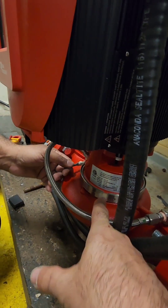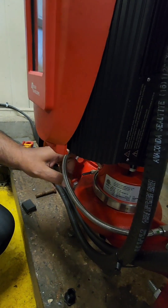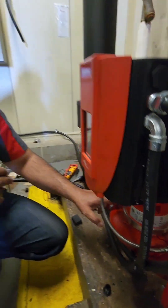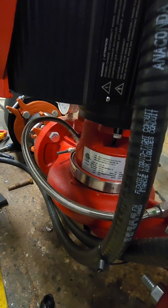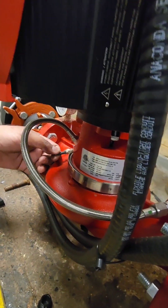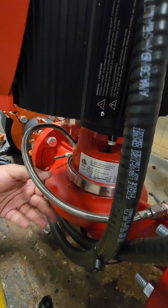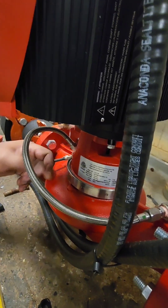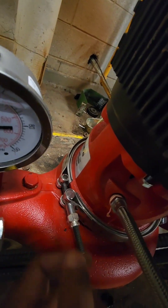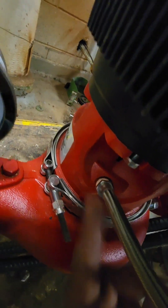This clamp here, Manny — can you explain the purpose of that? I don't see any bolts down there. So in our Gen 5 pumps, these are magnetic pumps, so we don't use bolts — we use clamps. That makes it much easier to pull. This is a pump adapter; the bolts are connected with the clamp and inside there's an O-ring. Whenever you come for servicing, just loosen this nut, the clamp is loose, lift the clamp up, and your pump can come out.